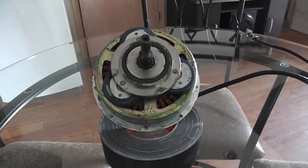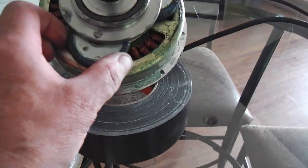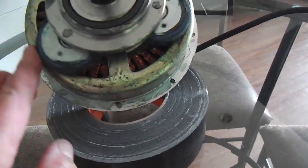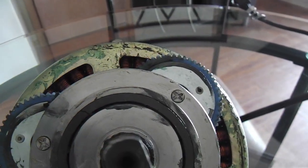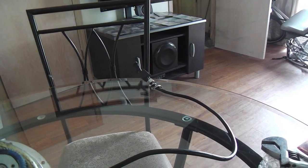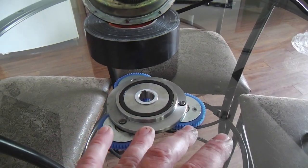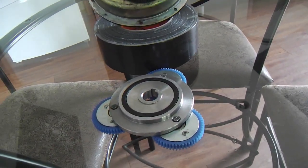The unit is out — and surprising findings. The gears are fine — they're like brand new, even after two years of wear. The more surprising thing was the clutch mechanism: there are broken seals — four breaks that I can tell right off the bat. The whole thing has to come off the line, and I'll have to chop off the ends and splice back on those connectors. But if that's what we've got to do, we've got to do it. I guess it was a good thing that I did buy this whole assembly, and it's nice to know that the clutch can fail before even the gears.